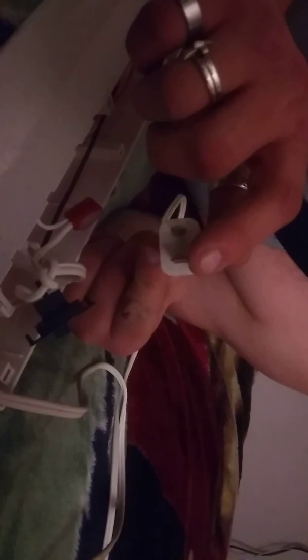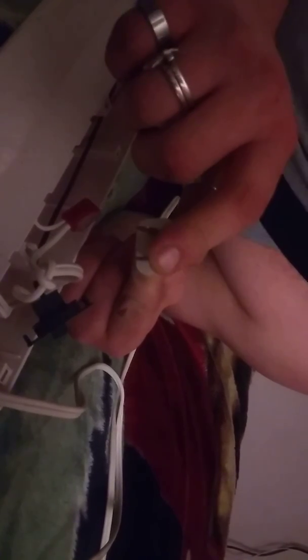So now you know this wire with the lines on it, it's going to be what wire? The white wire. Yeah, so inside the wall, the white wire is a neutral. So that's your negative. Black is your hot. That's your positive. So this would be your hot line. This is the one where the power is coming from. It's all coming down here.